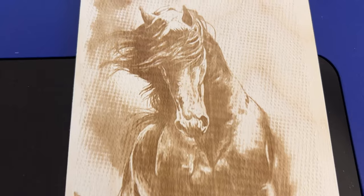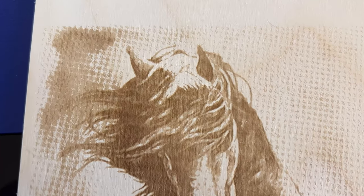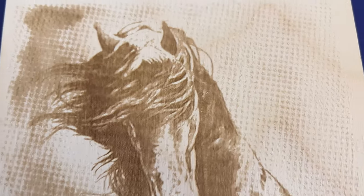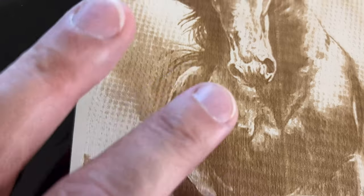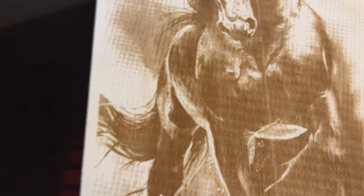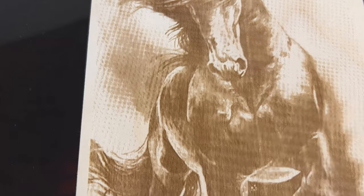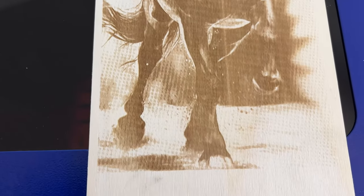After that testing, I decided to do something a bit more full scale — this is close to 8 by 10 inches, and you can see it's just amazing detail on wood. If you touch it, it's got a little bit of a rough surface. I believe I did this around the 5,000 millimeters per minute, 60% power mark using Jarvis. This image was also processed using the GIMP plugin, and you can just see amazing detail.